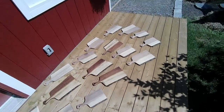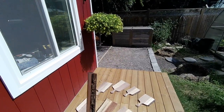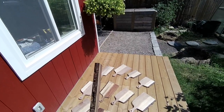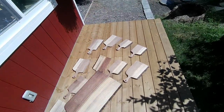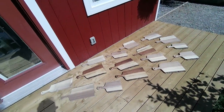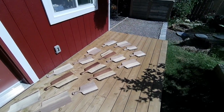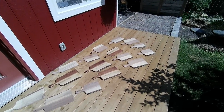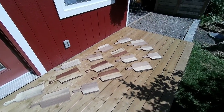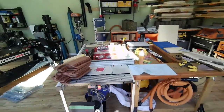Here are my boards that had a slight warp. I don't know if you can see this, but this one is probably like a couple thousandths of an inch off — but I see it. I don't like giving something that is wrong to my clients. These ones will be perfectly flat in probably about half an hour or so. Then, because I wet them, it's gonna raise the grain, so I'll give them a light sanding and oil them up and they'll be done.